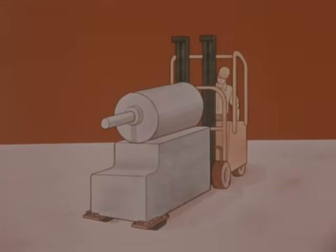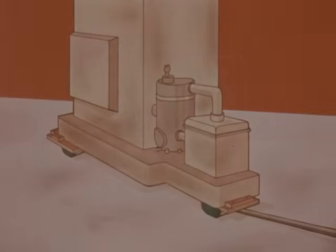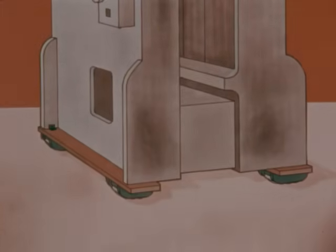The use of two skids placed at one end of the load will double the capacity of a fork truck. Swivel skids can be used when turning is desired, but they should be closely supervised. Rigid skids can be used to move in a straight path. On loads requiring three-point support, place two straight skids under the heavy end of the load and a swivel skid placed centrally at the other end. The single swivel skid is steered by the operator with the aid of the turning handle connector. Always use three skids unless the shape of the load requires the use of four.